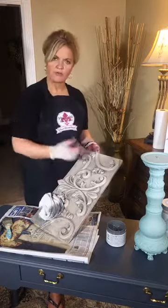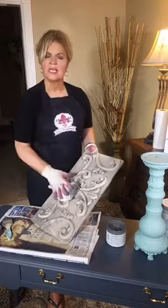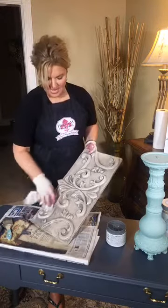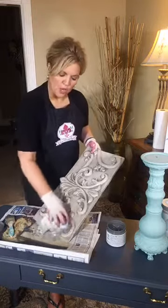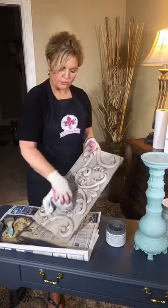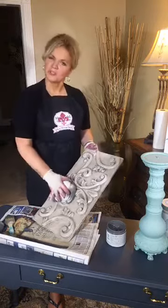So if you nick your drawer or your bed or whatever, you can always just take a brush and touch it up. If you put additional sheens on it, you can't do that so easily. So I always tell people it's better to not have so many coats. The more layers and thickening that you put on, the more chance of something chipping. Think about that in car terms and even fingernails: you put so many layers on, then your fingernail polish wants to chip away.